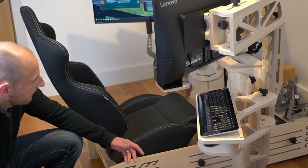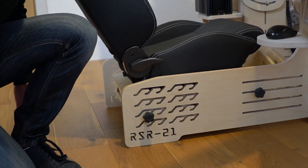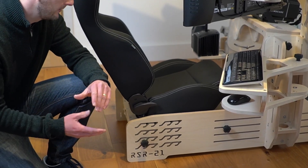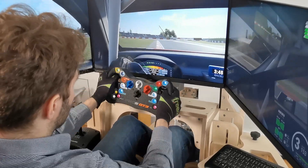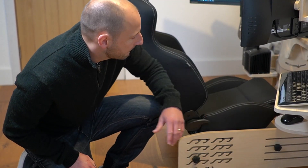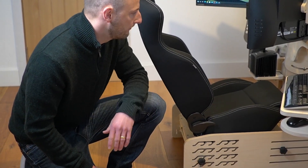This is the most important design feature of this rig: the longitudinal panels, the panels alongside you — the bulkheads. It's essentially more like a monocoque. You are loading from the seat to the pedals directly in a straight line. Most sim chassis are more like a separate chassis below you, with the driver and controls above, and the load goes in a U-shape — down, across and up. This is very much a straight line: no matter what orientation you have the seat and the pedals in, you are loading it in a straight line, which results in a much stiffer structure.